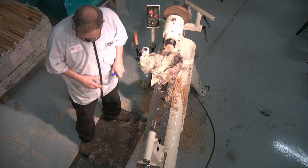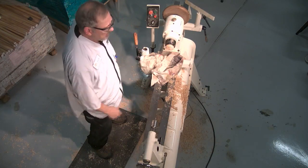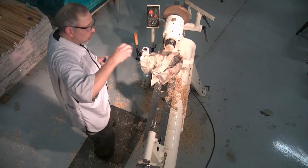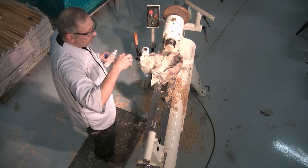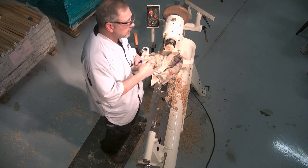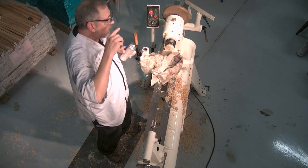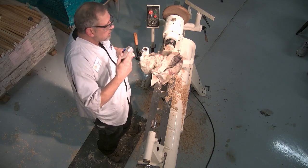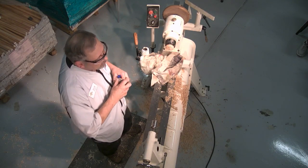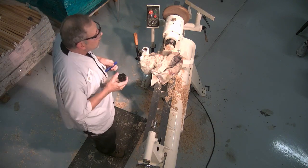My suggestion is, if you've got a piece of PSA paper, pressure sensitive paper, with the sticky on it, stick it on your bandsaw, because that's flat. Take the lid like this, set it down and go, and then try it a couple of times until it matches up. Remember, you're taking it off, and if you miss it, you can tighten it back up. If you need to come back just a little bit, put some lacquer around the edge of it to build the base back up, or nail polish or whatever you're using for a finish. Just put some heavy finish in. That'll help you back it up. But you're only going to back it up at the most a quarter turn, and I would say not even that. Does that help you? Other questions?